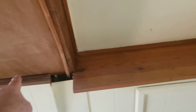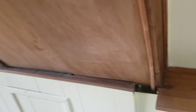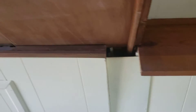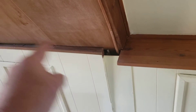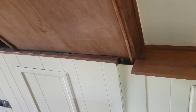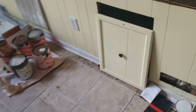There is a break in the plane of this wall — a chase that likely has electrical for the upstairs buried in it. As far as height goes, the base cabinets will come up to 34.5 inches off the floor, and the countertop can go back into the corners to hide some of that offset. However, that blocked-out area probably needs to be removed so we have a single plane for the cabinets to set against the wall.